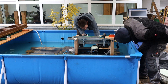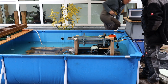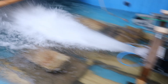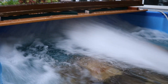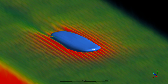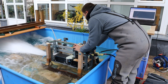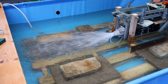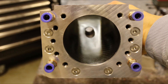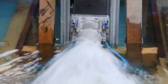What you just saw was the jet running at about five kilowatts of constant power. In that state it produces about 45 kilograms — or 450 newtons — of thrust. The maximum constant power lies at around 11 kilowatts, so much more is possible. The CFD simulation shows that up to 100 kilograms, or 1000 newtons, will be reached — but I'm too afraid to test it in the pool. On this testing day we had about seven degrees Celsius outside, and the motor reached a maximum temperature of 30 degrees Celsius, showing that the water cooling is doing what it's supposed to do.